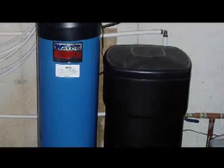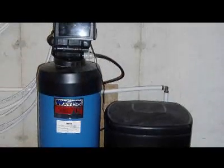But the important thing to remember about water softeners, you want a metering system and you want it to rejuvenate only on usage, not on timing. That saves water. Your home is 5 times more likely to be damaged by flood than fire. So when you call a plumber, you want to make sure it's a professional. Ask for referrals. Find out about their track record.